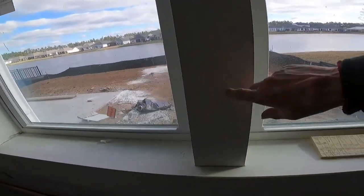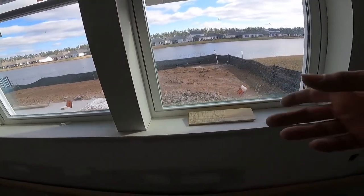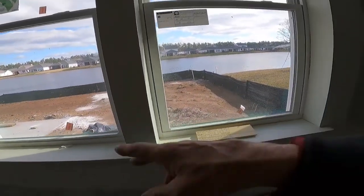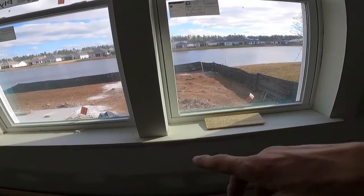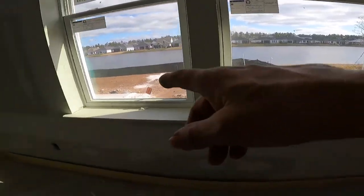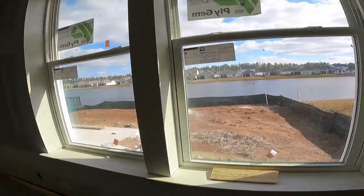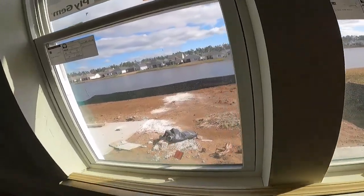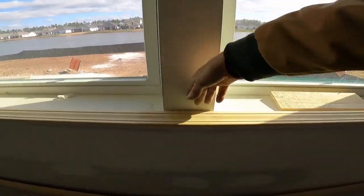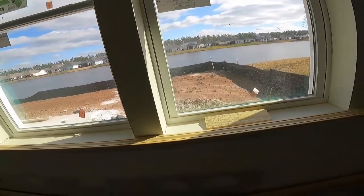Now, a rule of thumb, what we usually do is, if this is more than 6 or 7 inches, like about 10 inches or so, which some houses are, we make these into 2 separate window casing, 2 separate window sills. But if it's 6 inches or less, then we make it all one window sill. Okay? And it just makes for a nice looking job. That way, if they do go with the shutter blinds, it has something to sit on top here. The casing does.